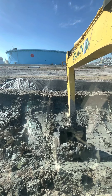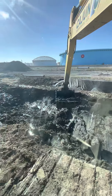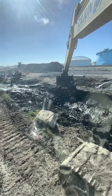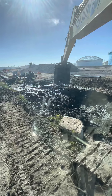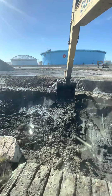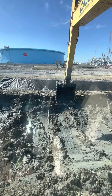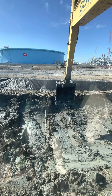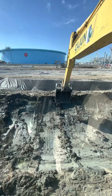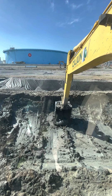It's better to take some good material with you when you're removing this wet material than to try and leave all the good material and leave bad wet material behind. It's better to take off a little more and leave no wet mud behind than to leave a good bit of bad material. Always better — I'll give you a little scoop here to show that.